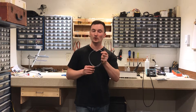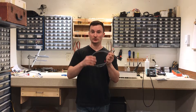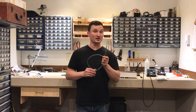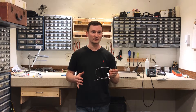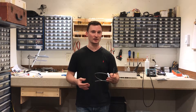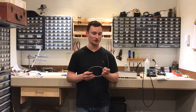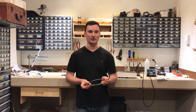In addition to those changes, I'm also going to be using this — 20-gauge, two-conductor shielded cable. I'm going to use this to wire the tube filaments, and I'll probably end up using the same stuff for the high-voltage supply as well. It may be unnecessary, but at this point I don't want to take any chances. It's such a tight space that I just don't have the room to space things as far apart as I normally would in a guitar amplifier, so I'm using this shielded cable to eliminate any possibility of interference from the filament winding or the high-voltage lines.